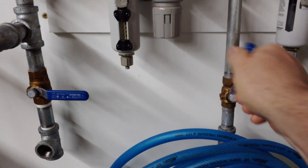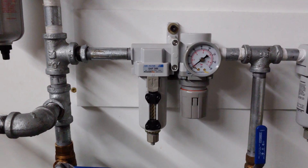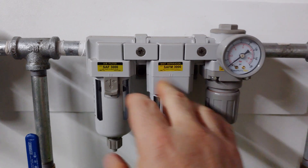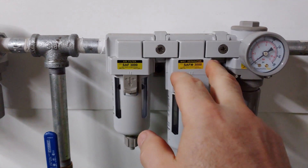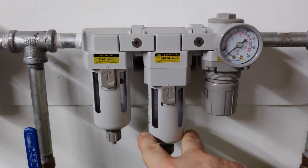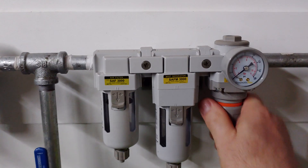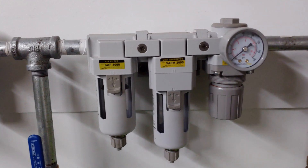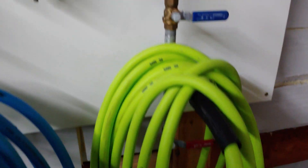This comes down to a leg I use for air tools and general-purpose shop air. The last stage of my setup is another filter and oil mist separator — a 10-micron filter and a 0.1-micron filter and oil mist separator that's supposed to remove 99.9% of oil aerosols and microscopic droplets. There's another regulator: the air coming into this unit is usually around 90 PSI, and the regulators cascade together so I can adjust it down for whatever I'm using. This line is generally for my HVLP spraying and has worked out really well.